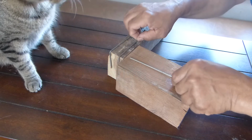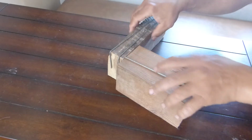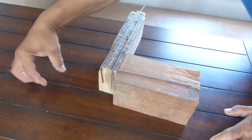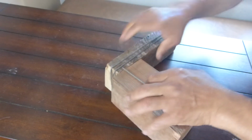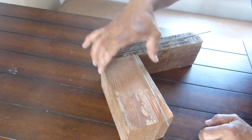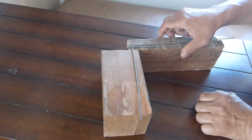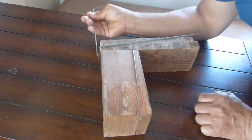Okay. So what you're looking at, this will be the column. This will be the slab up top. I'm letting you look at it in this configuration as if you can see through it. This would be the extension, the wall up top, and also the extension of the slab extending out. This is going to represent a rebar reinforcement. This is the wall, the garage wall. Garage wall, and rebar, just the one section of it. It's the slab. The slab goes out to here, roughly the end of the back side of the sheet piling.